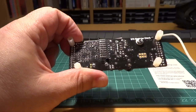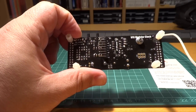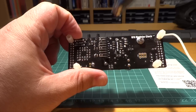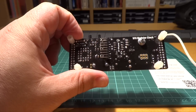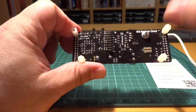The ICSP pads might come in handy if you prefer to use a programming environment other than Arduino. Here we can find the pins to connect the Adafruit GPS module. I've soldered an angled header so I can connect my NWTS device, which emulates a GPS using Wi-Fi and NTP. I'll later show how easy it is to connect and use with the AkaFugu clock. It can be powered directly from the clock.